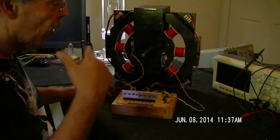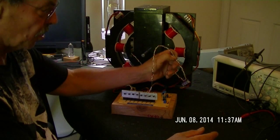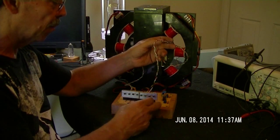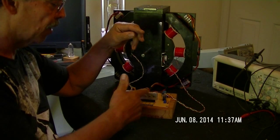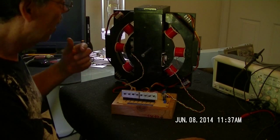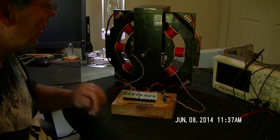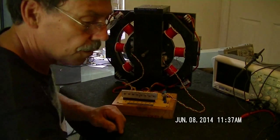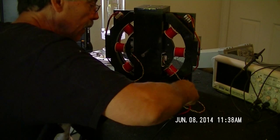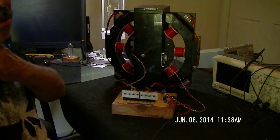One wheel will be driving at 20 to 25 volts peak, and essentially that's the peak these hall sensors will take. I could put a voltage regulator in here to channel the power for the hall sensors so I can take these FETs all the way to 35 volts — that's the next step. Right now I'm working on getting the timing done on this and seeing where this iteration takes me in terms of performance. Let's get this thing fired up — I'll start right at about 18 volts.